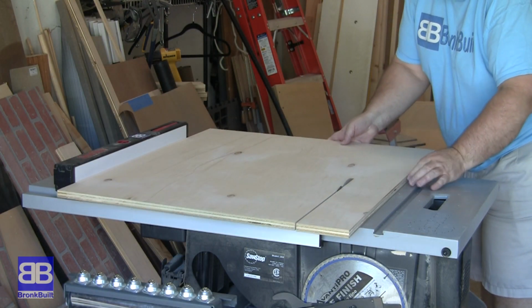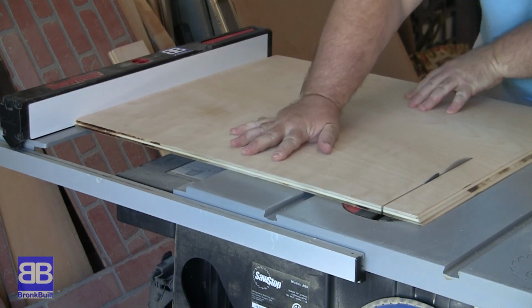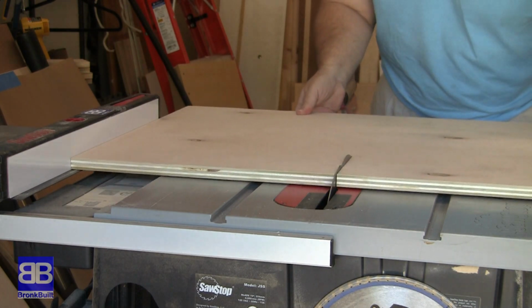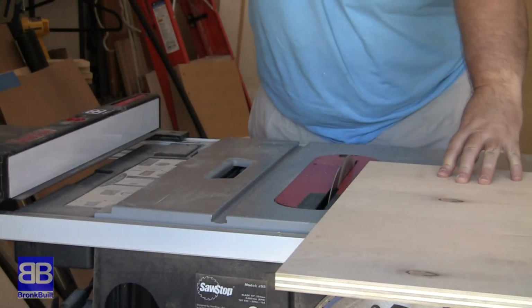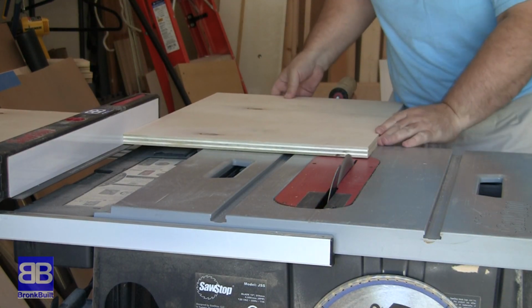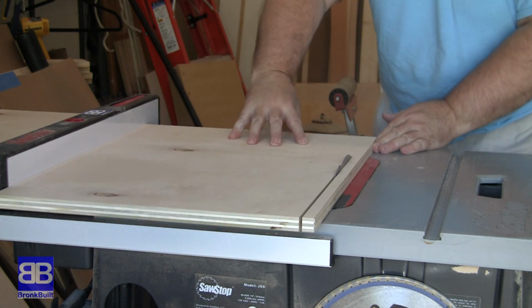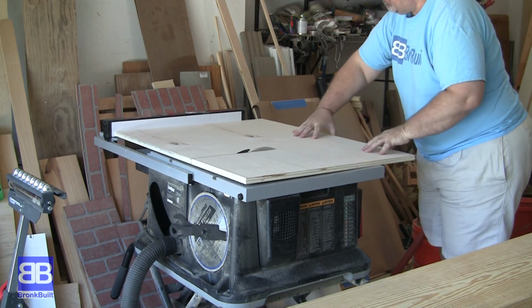Now that I have the basic box created, I now can measure the inside to get exact measurements for the shelf and the deep hamper drawer. Once I take those measurements and I'm sure about them, I cut the remaining pieces from what is left in my plywood sheets. I'm going to have just one large and deep drawer that will have a divider in the center of the drawer to create two sides of the drawer.